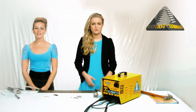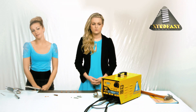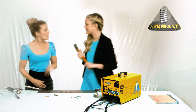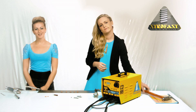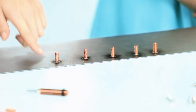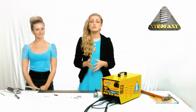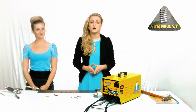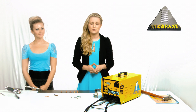So how do I know that I have a good weld? There are several ways of telling. You could just hit it with a hammer, but that is a bit unsophisticated. Firstly, look at the weld — you want to see a witness of molten metal all the way around the flange. Secondly, you could use the torque method with one of our Stud Fast torque testing bars, which once set will click over at the safe testing torque.